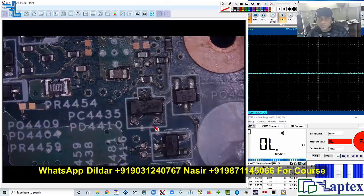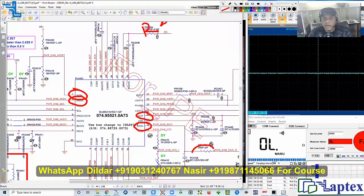This is the most important point — this voltage and current is required for the charging IC in order to charge the battery. The same amount of current as required must pass across this sensing resistor. In cold checking, this is the only thing we have to check here, and the rest we calculate on a calculator to determine what amount of AC_IN we need to get.